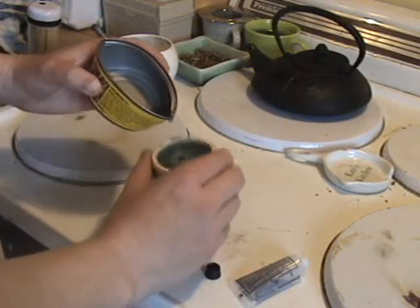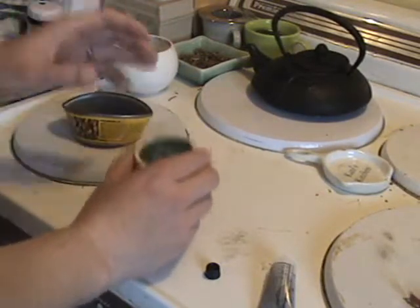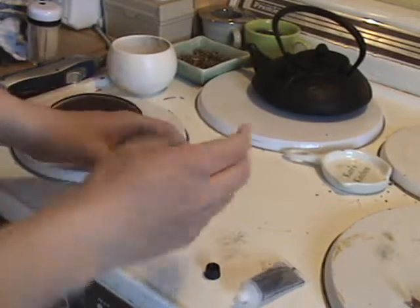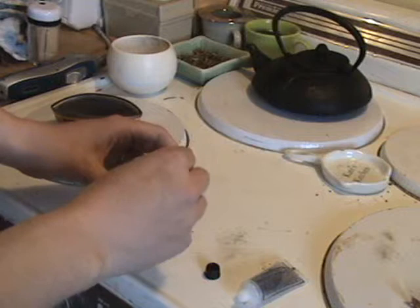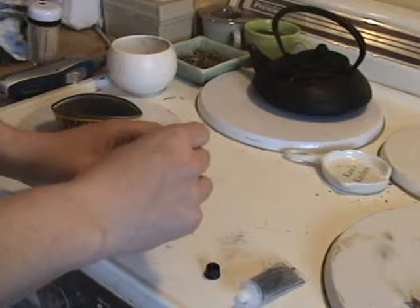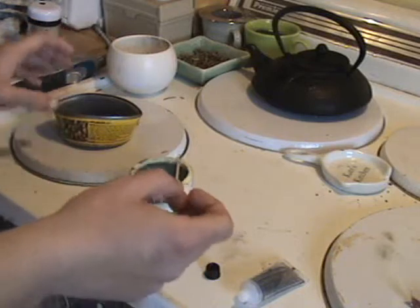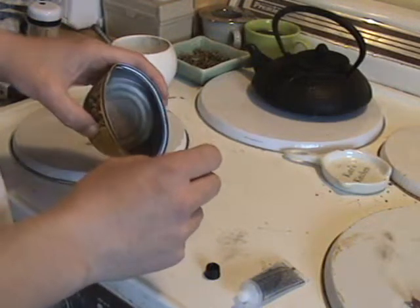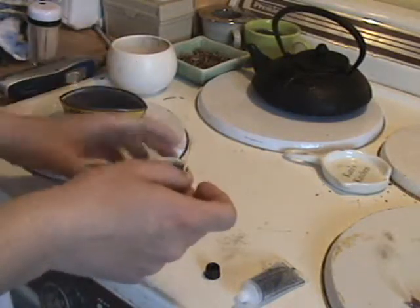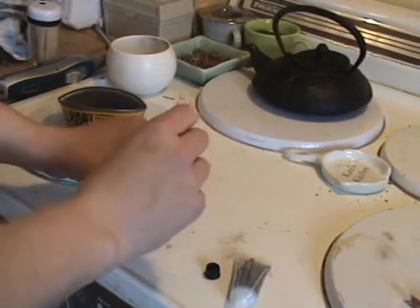in stages. The first stage, I have a tendency of pounding down on the mold. This helps to release any air bubbles that are inside the mold. And then I also take the toothpick and poke around on the inside of the mold, to make sure that any of the air bubbles that did come to the surface have released. You can see them popping up there. And we now have more room for more resin. And again, more tamping. More digging around with the toothpick.